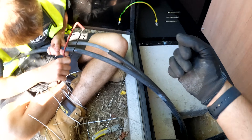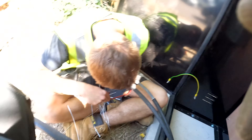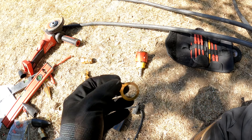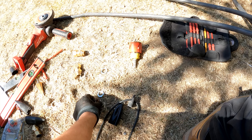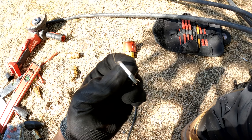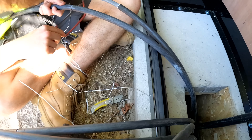When one guy comes in with a three-phase 22 kilowatt charger, the second is 22 kilowatt, up to four at 22 kilowatt. As soon as you plug in your fifth one it's going to drop them all equally to about 16 amps or so, so they're not all going to push over that 100-amp limit and set fire to the cable.